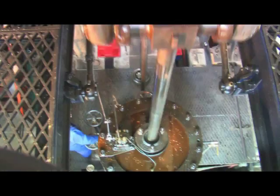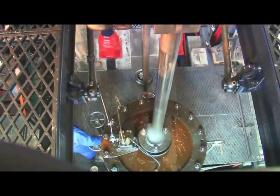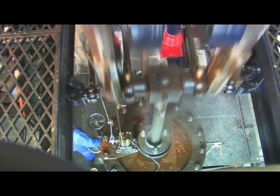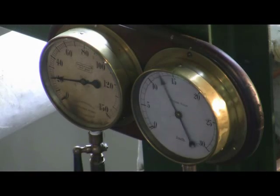The steam side is here — this is the steam cylinder. So the steam is used in there, and then it exhausts into a condenser, which creates a bit of vacuum. If you look at the gauges behind me, you can see this is the steam pressure, and this is the vacuum that's been created by the cold water coming into the exhaust pipe.